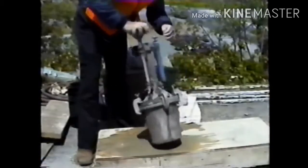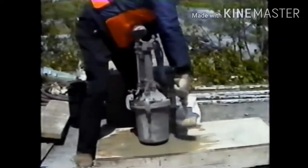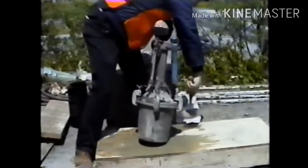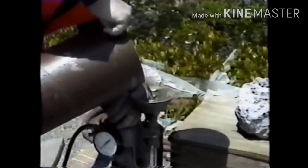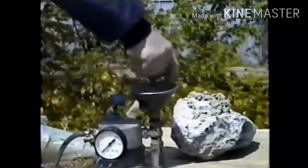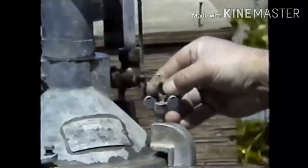The meter should be gently rotated and tapped with the mallet to remove any entrapped air that may remain. Next, water should be poured through the funnel valve until it stands at a level slightly above the arrow mark on the graduated scale. The funnel valve is then closed and the level is adjusted to the arrow mark by drawing off just enough water through the lower petcock.